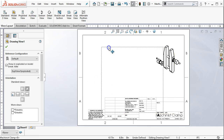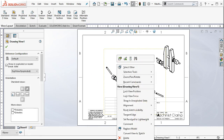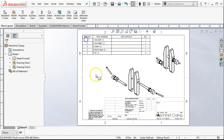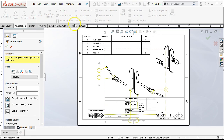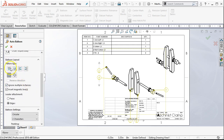Right click in the view at the very bottom — you'll see tables, and under tables, bill of materials. Standard bill of materials and we'll just place it. There's my table: item numbers, the part number or the part name, no description assigned, and the quantities. Under annotation, I want to auto balloon, and I'm going to align these starting at and incrementing by ones. I'm thinking everything should just go across the top. Grab the magnet line and shrink it, just kind of playing with the settings to get a feel for how they operate. Item numbers are attached to that line — if I want to detach, grab the item, pull it away and it's independent, or drag it back to the magnet line and it will reattach.